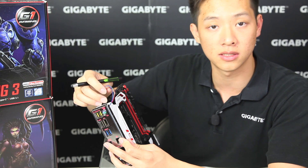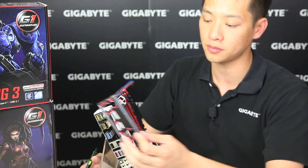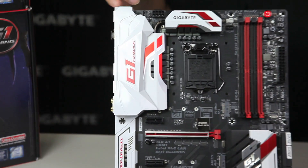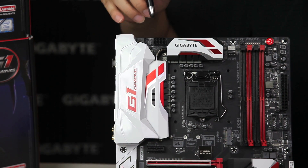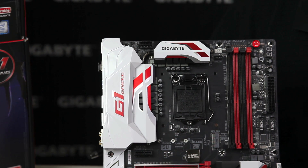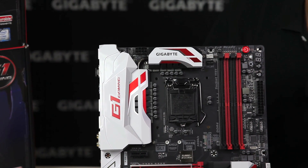This can still beat to the sound of your music. It can still pulse on and off, or you can have it on continuously or shut off completely. That's one of the cool functions you'll find in the Z170 series. We also have, next to it, pin headers for system fans. These are PWMs, so you can actually control them through the BIOS or even through our Systems Information Viewer in the App Center. We'll probably show that in another video to show you how to use our App Center.